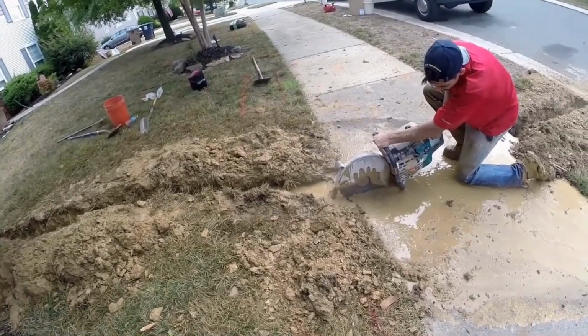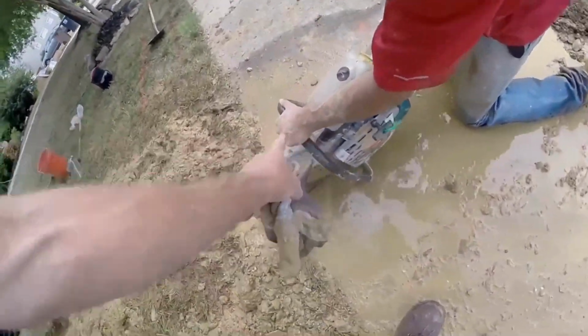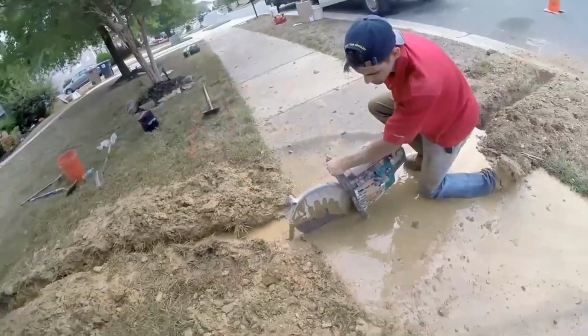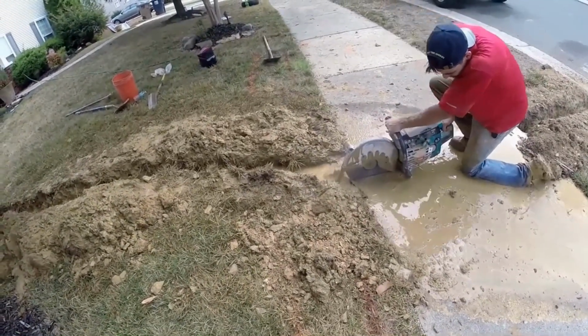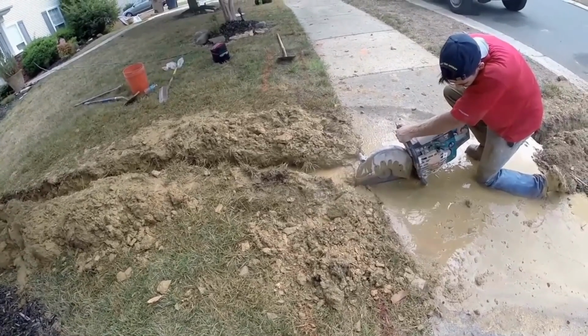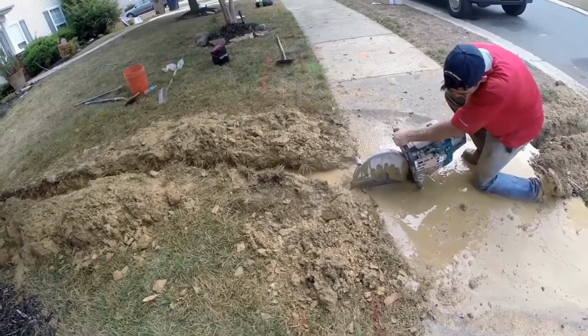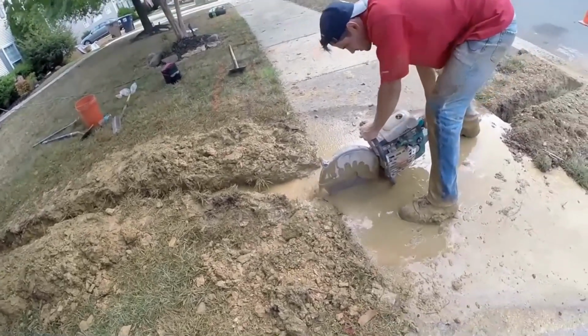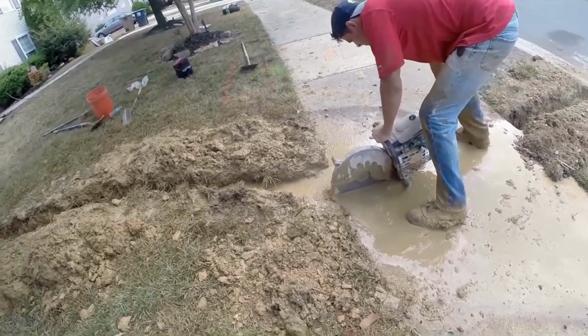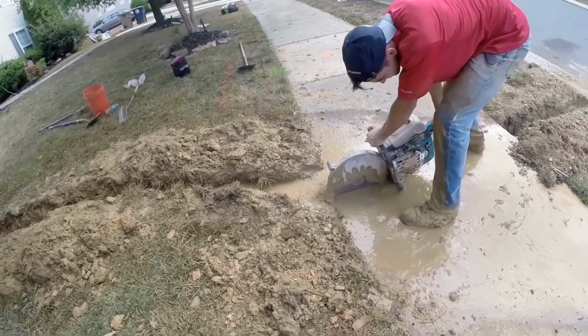What we're doing is we're using an expansion joint on the sidewalk for one side, and then the other side we have to cut straight across, only a shovel wide, just wide enough to get your pipe down underneath that sidewalk. You need to be able to pick through it. Once that's done, we will go ahead and make the V cut in the curb, and then we'll break this concrete out.